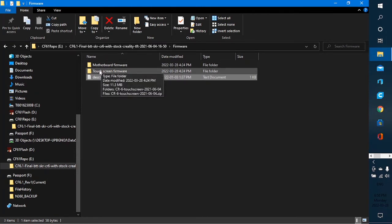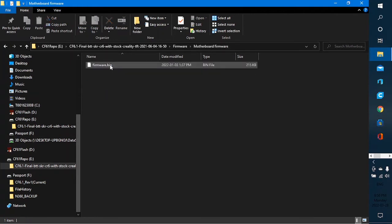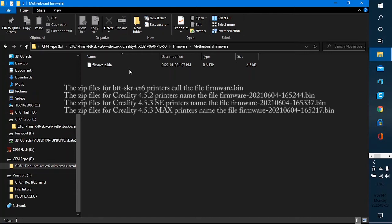For the motherboard itself, the firmware has already been compiled. The BTT board expects you to always call the firmware 'firmware.bin' in lowercase. It renames the file to 'firmware.cur' in all caps when it has flashed successfully, so you can tell from the file name whether it did or did not flash. That is not the case for the Creality motherboards — the 1.1, 4.5.2, and 4.5.3 boards all require that the firmware be a unique name every single time you attempt to flash. He uses the date and timestamp to make it a unique name each time.